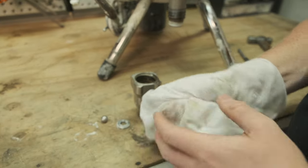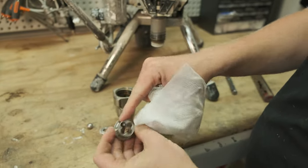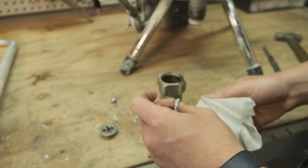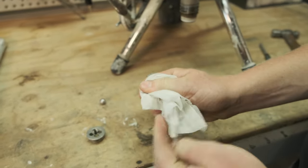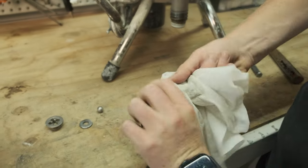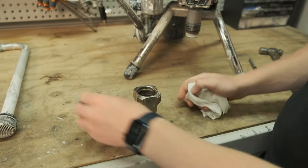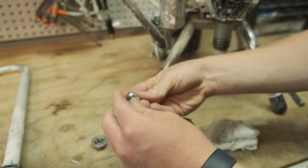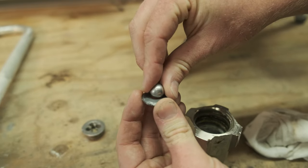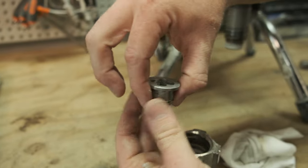Now that we've got them out, we'll give them a quick wipe — just a rough clean. If there's too much paint build-up around the edges, the seat can be lifted, allowing the pressure to seep out. Cleaning these can fix most of your priming issues or pressure issues. So if you're priming but not building pressure, sometimes it can be that the lower ball isn't seating correctly — it's just been lifted slightly and the pressure is seeping out the bottom.